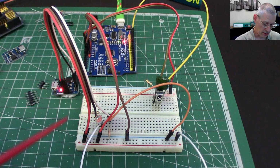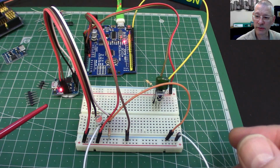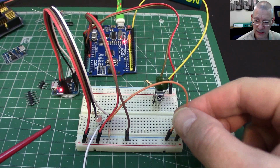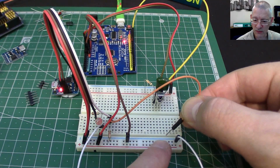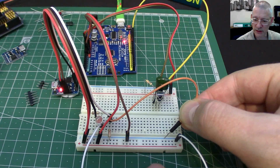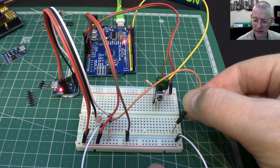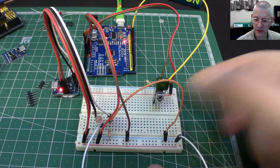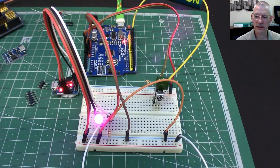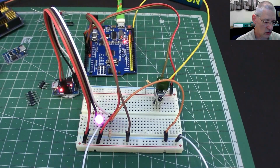And that's it. Well, apart from a little bit of business logic, just to prove that one of the other GPIO pins could be used as an input. If I disconnect this orange wire here, which is currently connected to ground, if I take that off, it all stops, because the logic says only when this is low will you do the blink. Okay, off, on, off, on. Okay, great, I thought. At least it understands the Arduino code. So let's have a look at that now.